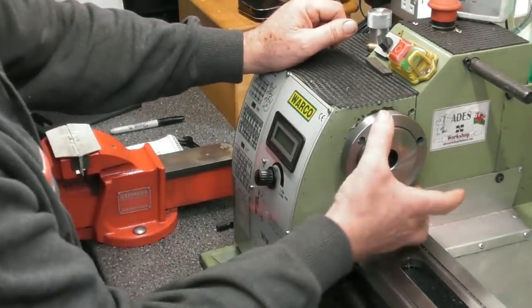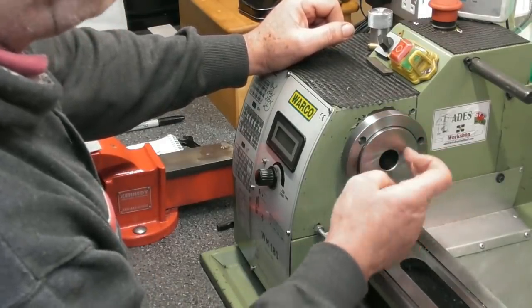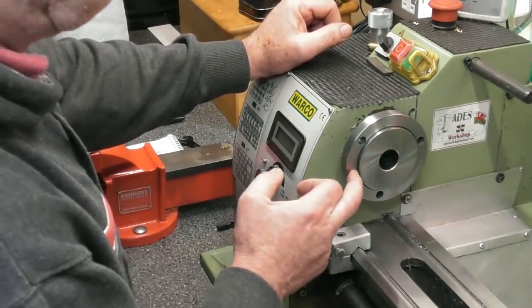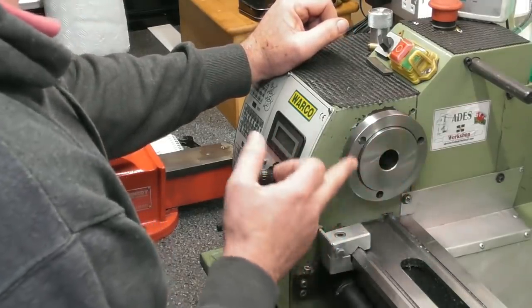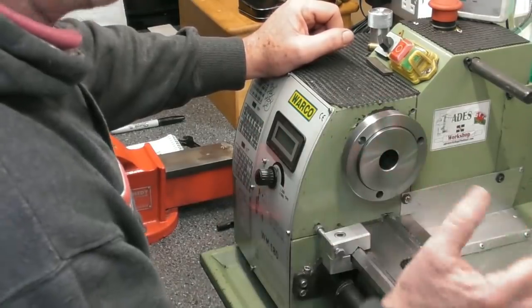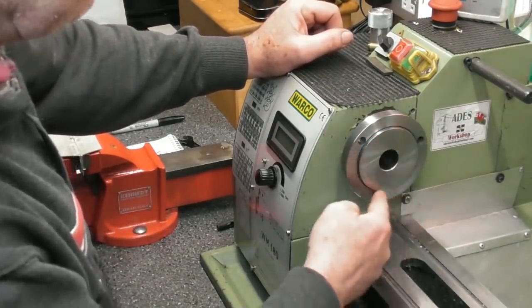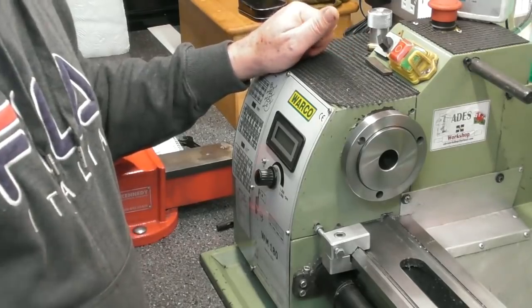Just one further note: I'm looking for a diameter of 100mm. The register here is 72mm, so if I bore out a little register in the plastic at 72.25mm — measuring up a 3.2mm step — I'll try and keep to that sort of step height. It also has three holes on a PCD, and the PCD of the holes on this particular head is 84mm. So: 72mm diameter, 3.2mm step, and 84mm PCD with three equispaced holes. I can then put my three-jaw chuck up and start making the protector.